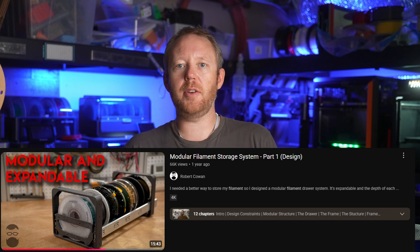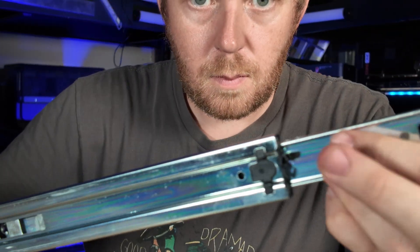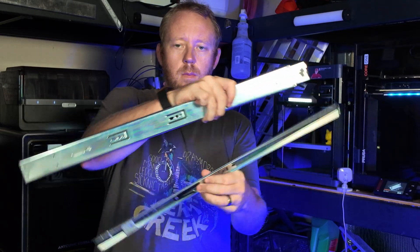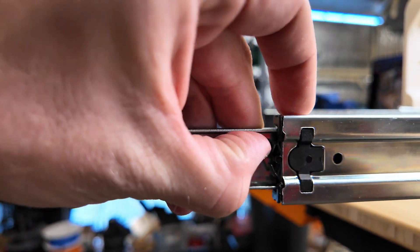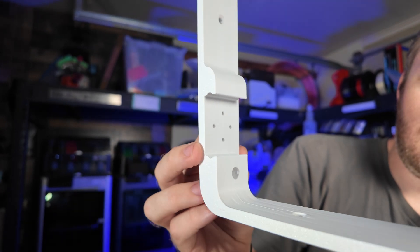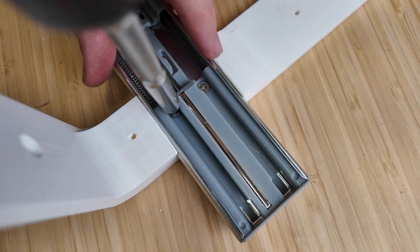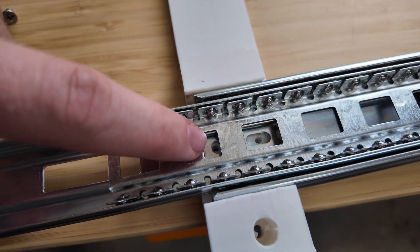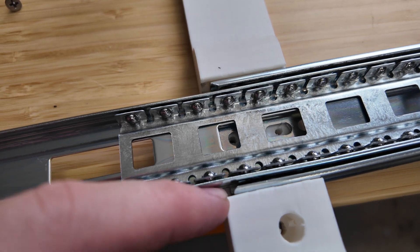The assembly of this was actually quite simple. I referenced Robert's video to get an idea of how to do things. I started by removing the interior slide from the drawer slide — doing this makes it so much easier to reach the screw holes when attaching it to the frame. To remove it, extend the slide all the way out, find the small latch, push up on it, and pull — the slide comes right off. I slid the drawer slide into the frame and the fit is absolutely perfect. Using the smaller screws, I attached the slide to the frame with two screws, then used another two on the second frame. You want to use the very first hole to line them up properly.